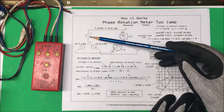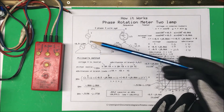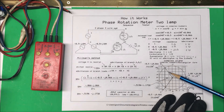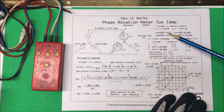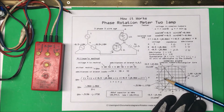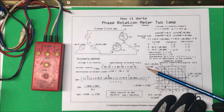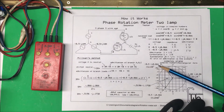Phase A is right here — that's one volt at zero degrees, so we write that as 1 + j0. This j is just an imaginary number and it allows us to rotate counterclockwise around this plane. Phase B is 120 degrees away from phase A, so we take the cosine of 120 degrees which is minus 0.5, and the sine of 120 which is plus 0.866, giving us minus 0.5 + j0.866. We go minus 0.5 this way and up 0.866, and we wind up right here — that's our voltage at one volt at 120 degrees.